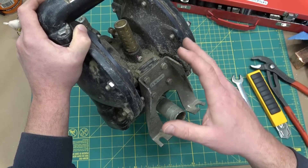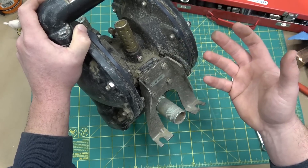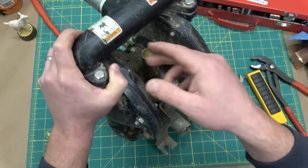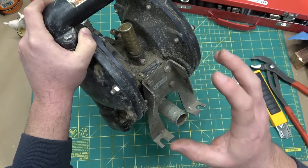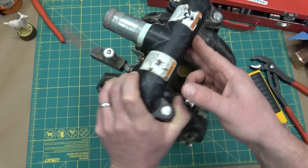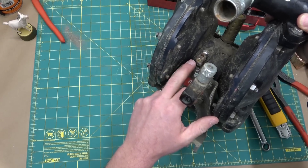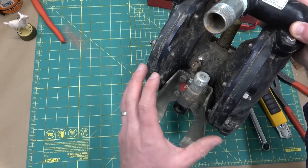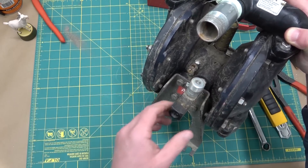There is a caveat. Because we're using air as the prime mover, you don't think air is particularly flammable. But because we have air moving through this system, it generates static electricity. So in order to dissipate that static, if you're using this in an explosive atmosphere, you must have the body — the chassis — grounded properly. Otherwise a static charge can build up just from the air moving through this, and that's your ignition point.